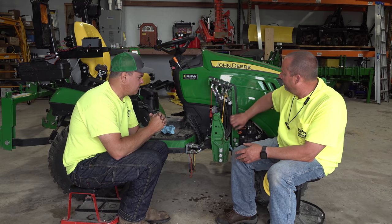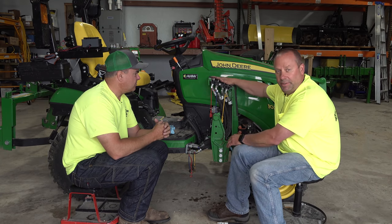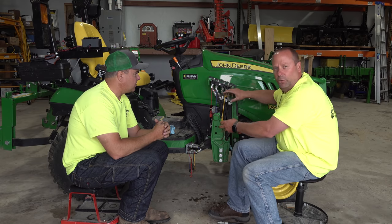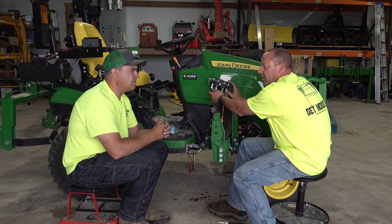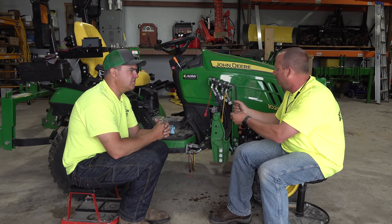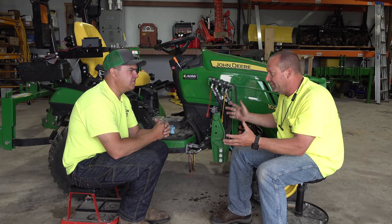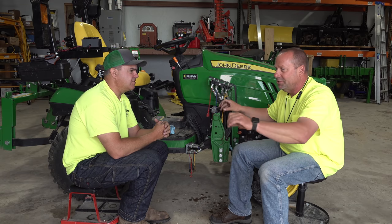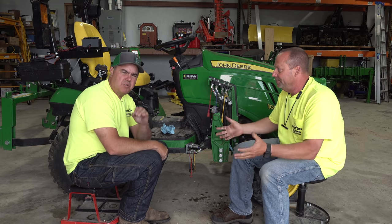No, there are so many fittings. Like this machine has the single point attachment option. There's five places right here that oil could leak. And it could be that when a dealer assembled this, they didn't snug up one of these fittings, so it's just dripping a little bit. On a front end loader, there's all kinds of fittings all over the thing. T-joints where the fluid separates to the two cylinders, at the cylinders, at the couplers, at the hard lines to the hoses. And they come loose.